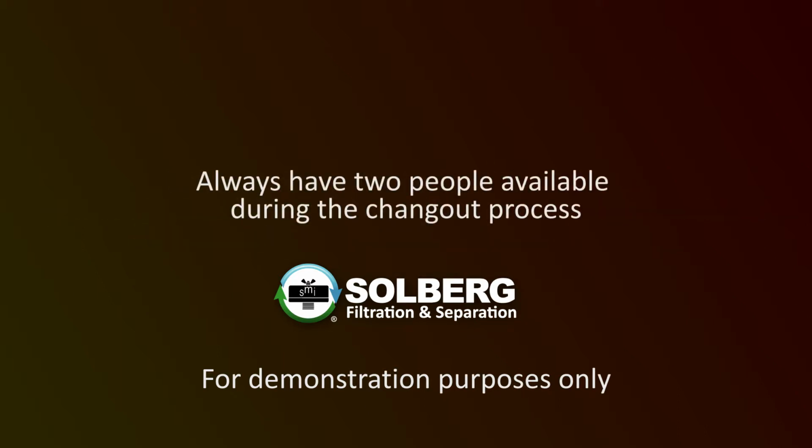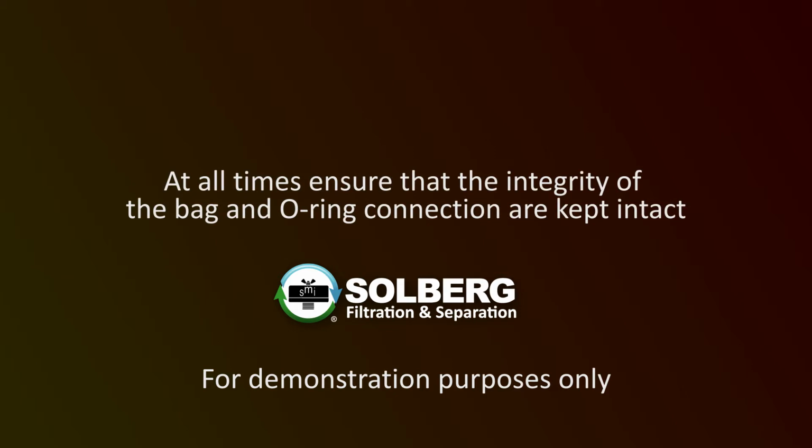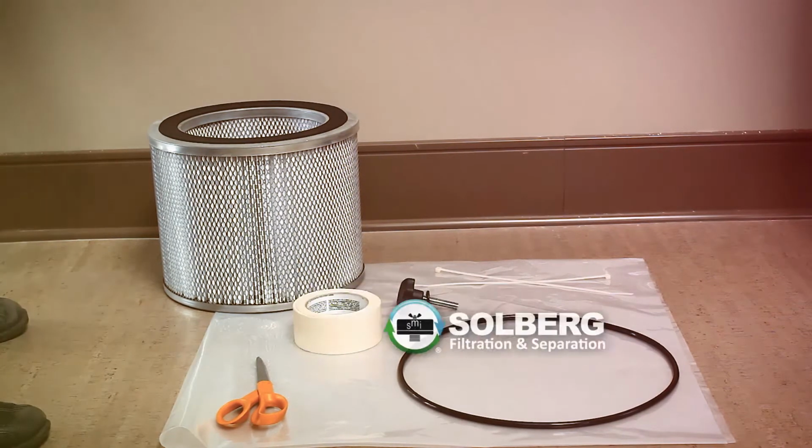The task of changing out the replacement element requires 2 people at all times to ensure proper and safe change-out. At all times, ensure that the integrity of the bag and the O-ring connection are kept intact. Before you proceed, you will need the following items to remove and install the element.